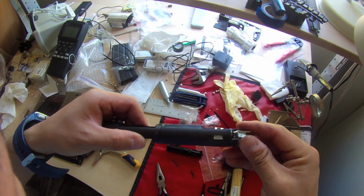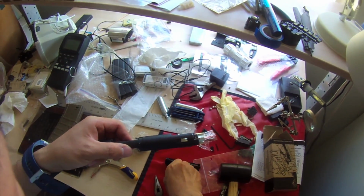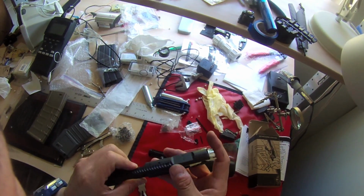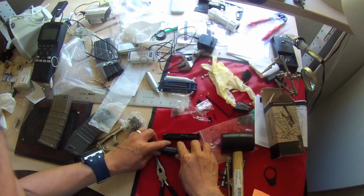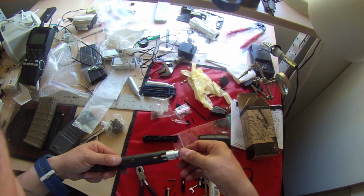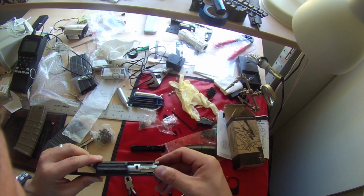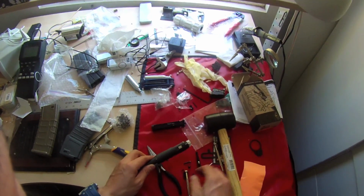You can visually align the nozzle spring hook with the pinhole in the back. You can see the hole of the spring on the one end if you look through the hole, and then once you see the hole pass, you can put the pin back in so that you know that pin is holding the spring. You can test it out by pulling the nozzle out, and the spring should pull it back in.